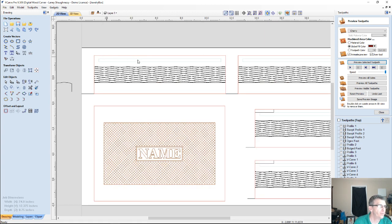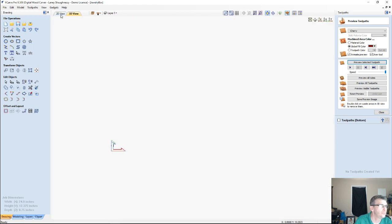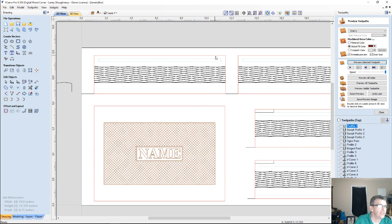Now on the top of the board here, this is going to be the front. My mortise is not going to go all the way to the front of my piece. I don't want to see the mortise when I open the inside of the box. It's going to be limited. But I'm still going to be drawing on this because this is the outside of the box and the bottom side is the inside of the box, right? And my hinge, the lid's going to be hinging off this, so the mortise has to get cut here.